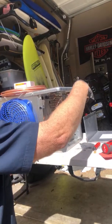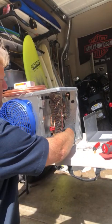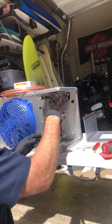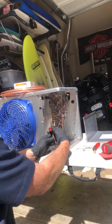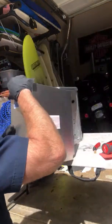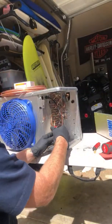This cord comes over if you need it for your solenoid valve, but on this one, the customer wants to reuse his valve. And his valve you'll see tomorrow when I film, the solenoid valve's out here in the box, and there's not a lot of room on either side of the coil. I'm probably going to bend some copper around the back and the sides here. And what's nice about it is these panels come out from the front for the future.